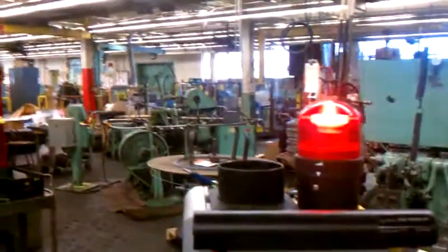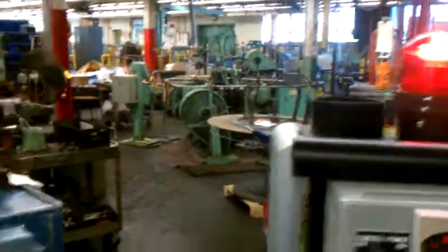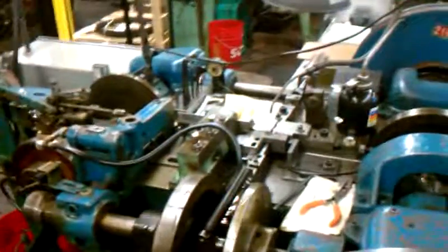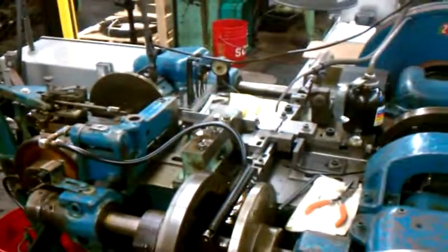The next mode of operation is jog. When in jog, the light's still flashing because the light curtains are bypassed. And if I push the run button on the control station right here, I get a nice smooth slow jog to make sure that everything's functioning properly.